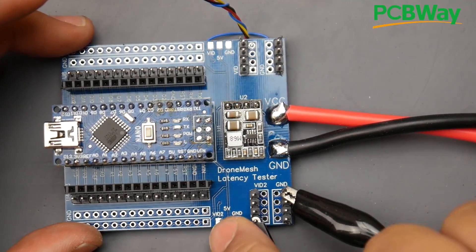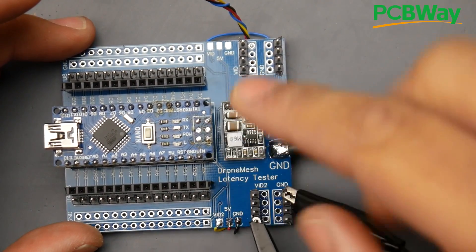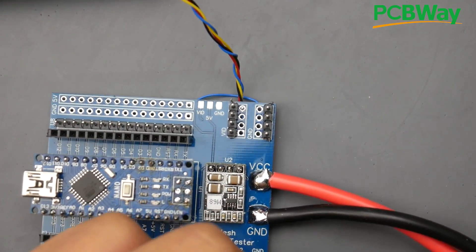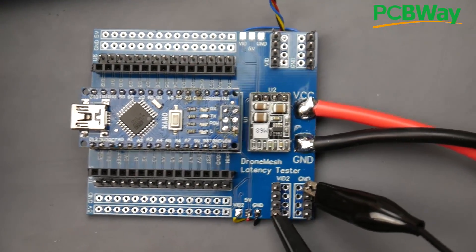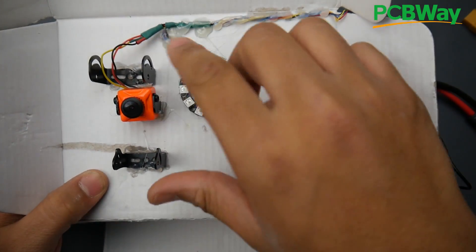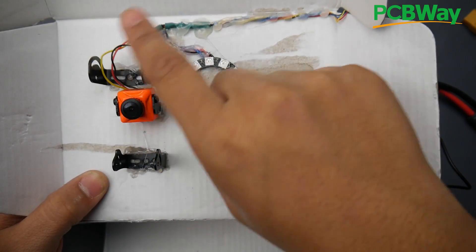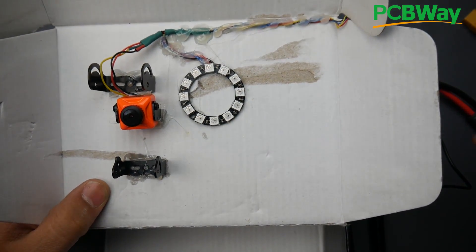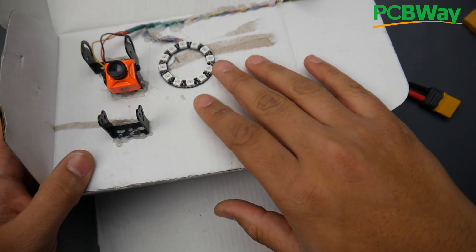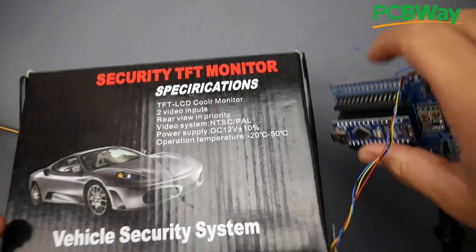Let's take a look at these pads. These are going to the camera — 5 volt, ground, and video. The 5 volt and ground are also going to the LED, and the video is just piped to this pin right here. The LED is connected down here; I soldered it in the back for quick use and will create a proper connector later. There are four wires going in — one for the LED signal, and ground and power sharing the 5 volt rail. There's also an extra wire for the video signal from the FPV camera to test latency. When the LED turns on, the camera sees the light. This is also an RGB LED, so later I can switch colors and see if the latency remains the same.